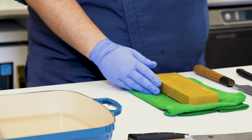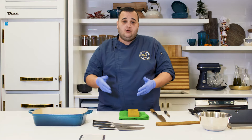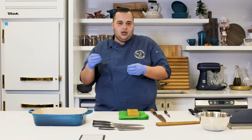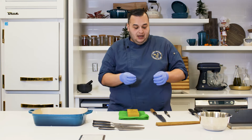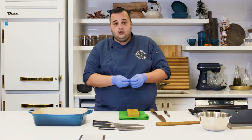For beginners, you want to be buying a 250 stone, a 750 stone, and a 1000 stone. Be cautious when choosing what stone to buy — if you choose a really high grit stone and your angle of approach is incorrect, you're going to create a really fragile edge and could create immense fractures in the actual metallurgy of the blade. You could actually lose your knife. Angle of approach and grit stone choice are very, very important.